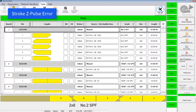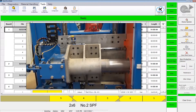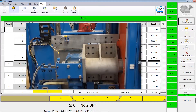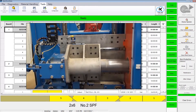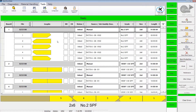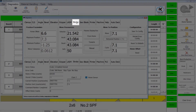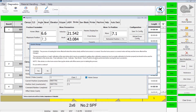Beware of a possible Stroke Z pulse error. Depending on where the Stroke Z pulse is located, when the Home System button is pressed, in rare cases the stroke axis may retract all the way to the hard stop and display an error. To remedy this, go to Diagnostics – Detailed Diagnostics in the blade software at the HMI. Click the Stroke tab. Click the Reset button under Home Offset. Calibrate the Stroke Axes.